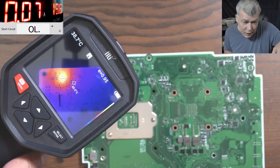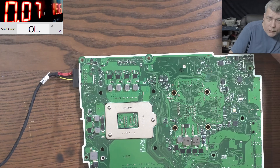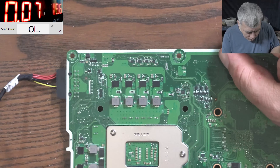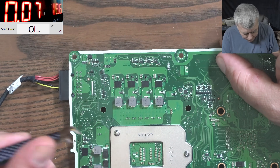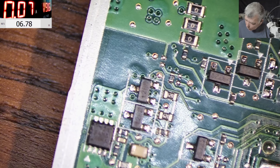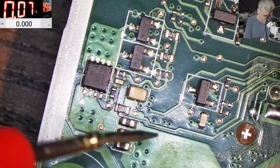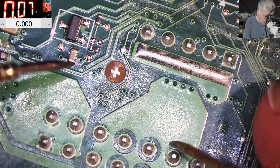That's the input circuit. The next MOSFET is probably in series with the power. Check the power connector — you can see red, so this must be the positive rail. You have a few inductors, then it goes to the MOSFET. Those two transistors are getting hot — let me get the multimeter to figure out why.